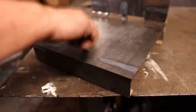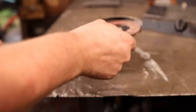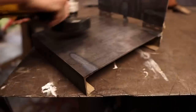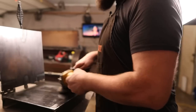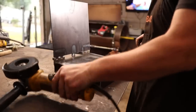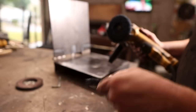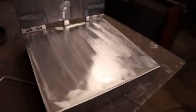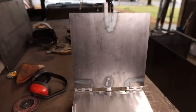To make this thing food safe and non-stick, we really gotta strip this down to bare steel, which is probably the most annoying part about building a tortilla press. Now we sand for the next 35 minutes. These blue paint removing wheels work pretty well too for taking off the scale. Look at that — nice and shiny. This is also a really good time to just round off your edges and make sure everything is nice and clean and shiny.